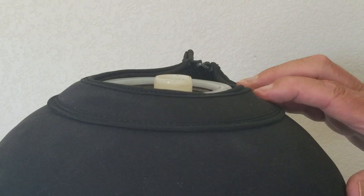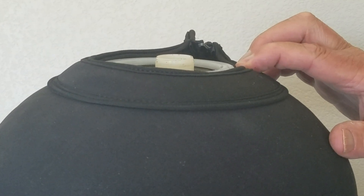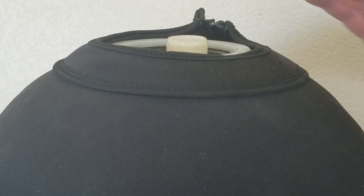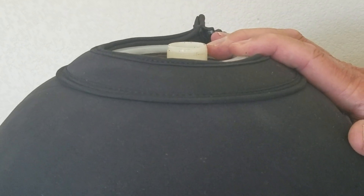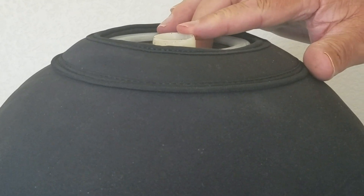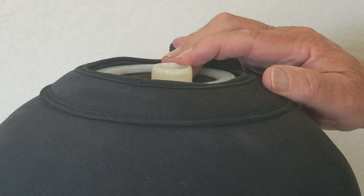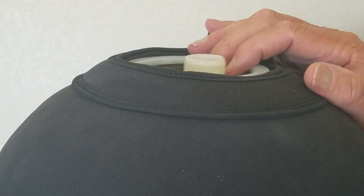This is a 48,000-grain water softener. From 24,000-grain all the way up to 48,000-grain it's already preloaded with the resin. If you purchase a 64,000-grain or larger, it's only going to be partially loaded with resin because of weight restrictions for shipping. You're going to receive a blue funnel and some extra resin. All you do is use a cap or tape to cover the top of the tube so resin can't get down in it, stick the funnel over the top, add the resin, then remove the plug or tape from the tube and clean the resin from the threads with a soft brush or water.